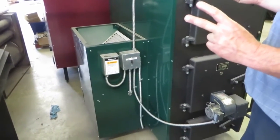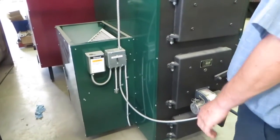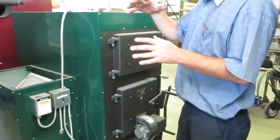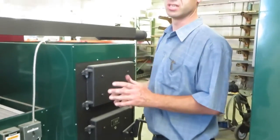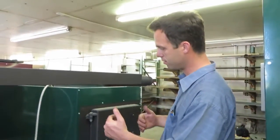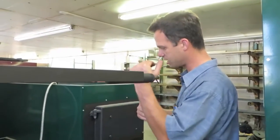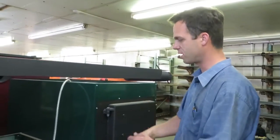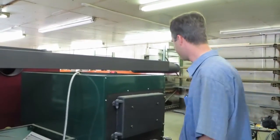You need two thermostats or a two-stage thermostat — either or. Those thermostats will be set within about five to ten degrees of each other, so that if your room temperature in your house gets below — let's say you have it set for 70 degrees and it gets down to 65 — it'll assume your wood fire went out and it'll fire your oil burner automatically.